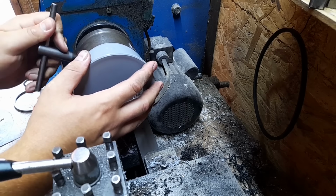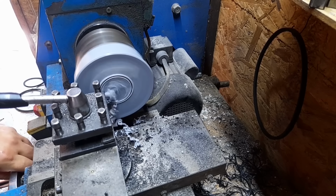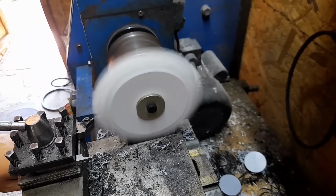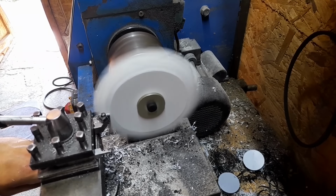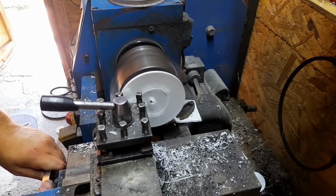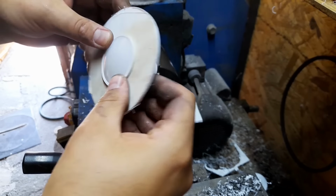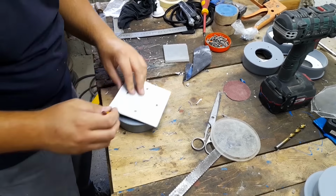I am going to show you how I made the lamps. I cut holes into these PVC pipe ends that are exactly as big as the spotlights. Then I cut a hole into a thin plastic piece that is going to hold the light bulb itself in the center. I struggled a lot with this part too, but editing makes it look like I didn't.